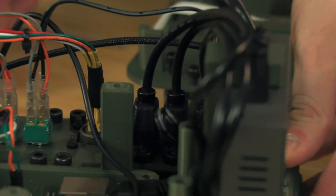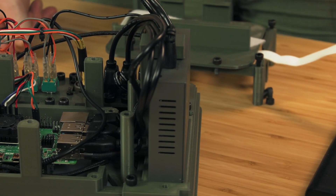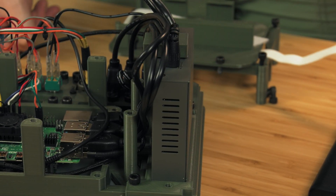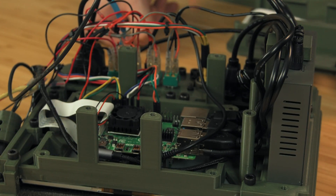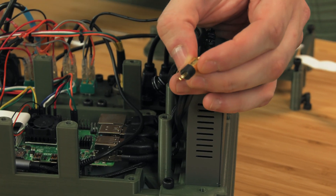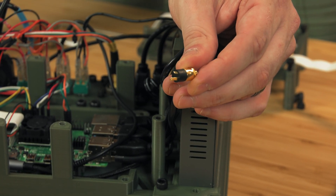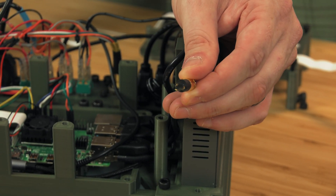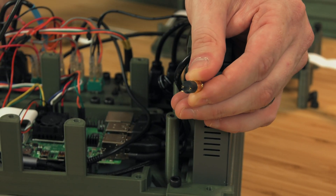You can also see the layout includes a five-port Netgear network switch, USB pass-throughs into the Raspberry Pi, and the rest is fairly standard cabling — a ribbon cable to the touchscreen, cables to the IO pins going to some front panel devices and to the screen itself, plus power and auxiliary jacks. It's worth talking about auxiliary jacks for a moment. These are fairly inexpensive but very tiny devices, and the wiring is not always clear. Similar to the toggle switches, information online isn't always super helpful, but if you know how to read a basic device diagram you can find what you need for these three-pin audio jacks. Basically you have a ground pin and a left and right pin that connect to the various parts of the jack.